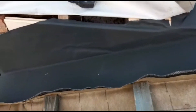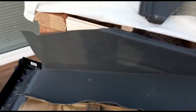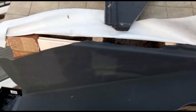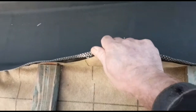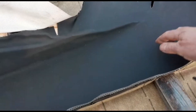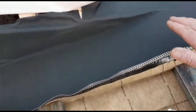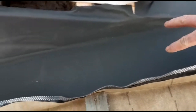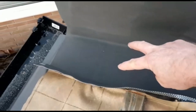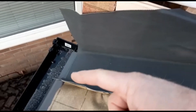I've got it stuck down there, which is fantastic. The fascia bottom covers all that. There's my trough. Plenty of excess on here to curl it under. So basically when the rain comes down here, hits this — I'll have a curl on there, can't go underneath. Tiles will overlap there about that much, so straight down. And that's basically the trough that takes all the water from the valley into the gutter.